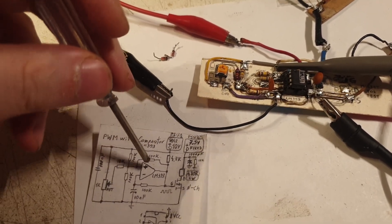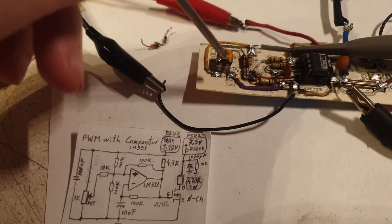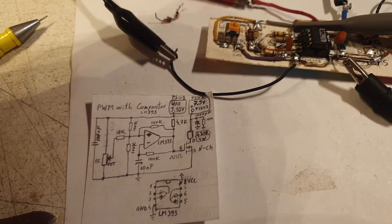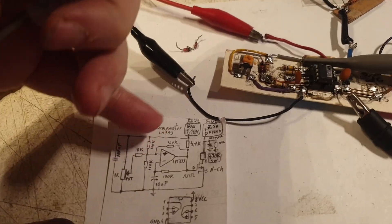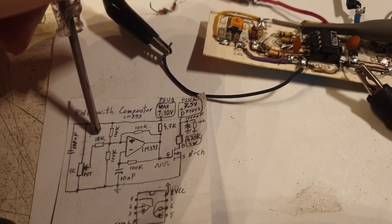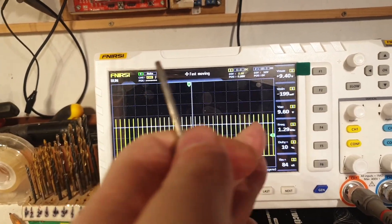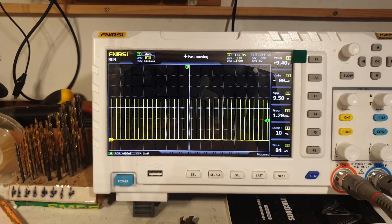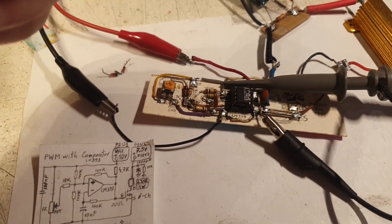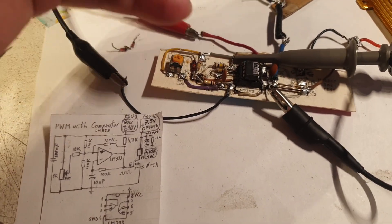In reality I changed a lot of resistors — even this 10K going to the potentiometer, I changed it about 10 times to understand that going lower than this value makes it unstable. My conclusion after all these changes: first, circuit stability is paramount. Second, this circuit is limited to 10% minimum and 88% maximum. But it really doesn't matter — this is a testing circuit and it's highly hackable. I can intervene and change something whenever I want.